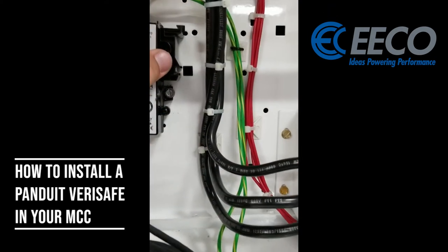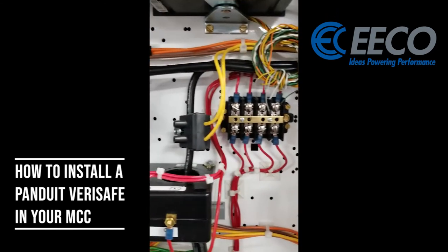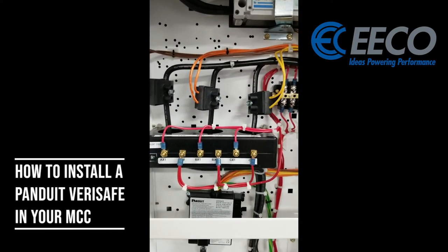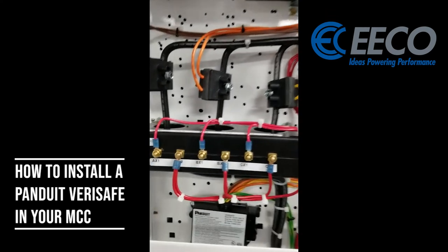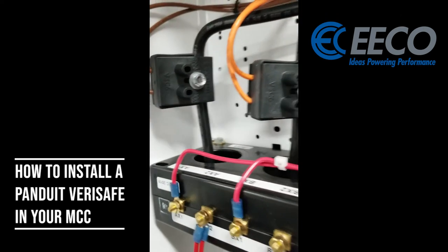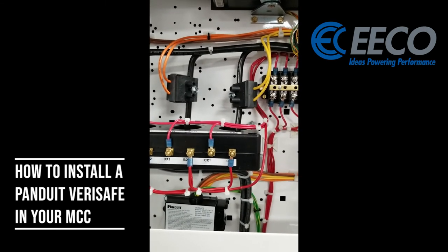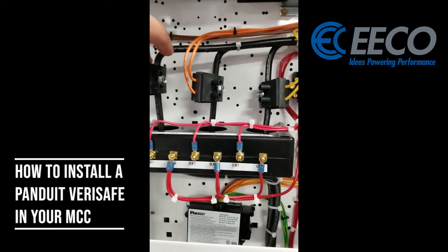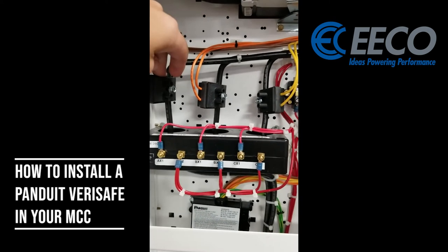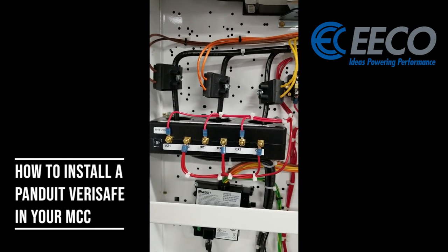You'll notice there's a nipple coming out of the top with a whip. We've got a ground wire that you need to connect to ground, and then our phase wires. Those clamps you see are insulated clamps that come with the Panduit VeriSafe. You clamp it around a wire — there are two wires from the VeriSafe that go in there to check, and this goes up to 600 volts. There are piercing connectors that when you tighten down, pierce the wire, so you don't have to cut wire or install it anywhere. You can also just take the leads and land them in a terminal block or on a breaker. But this install is clean, safe, no exposed wires — it's all rubberized and insulated.